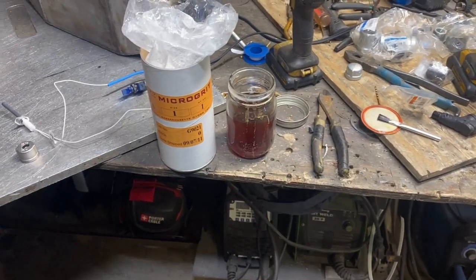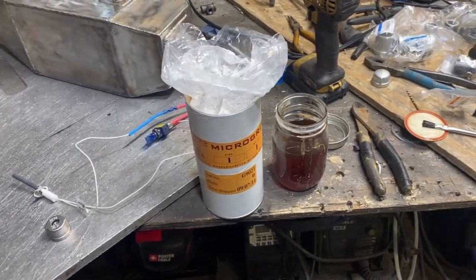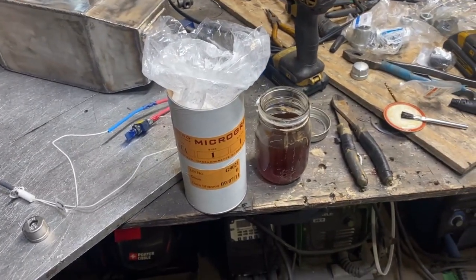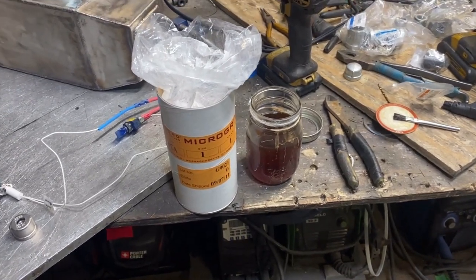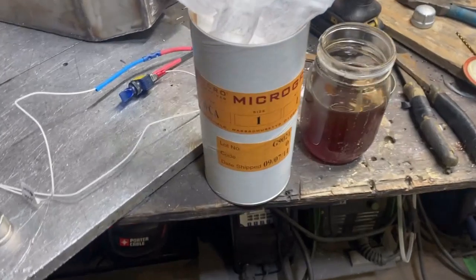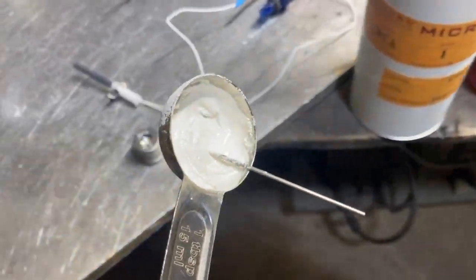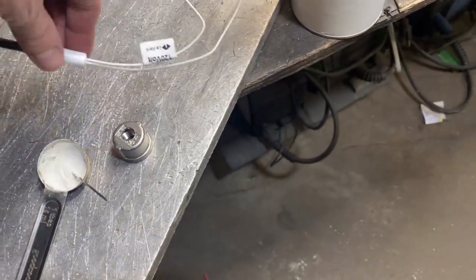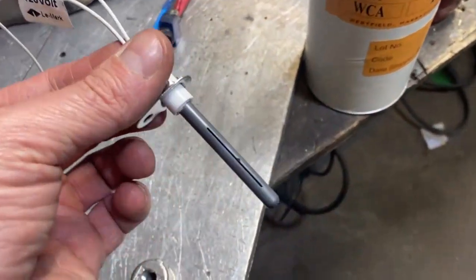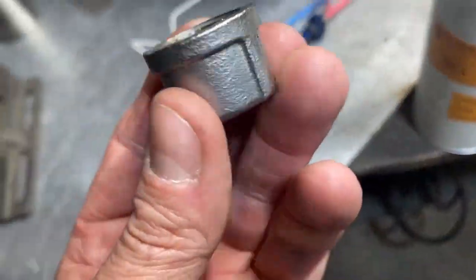This is a pyro formula for the water glass — this is what they used at the Los Alamos nuclear laboratory when they were doing some work with smelting plutonium and such. This is one-micron aluminum oxide powder, and I'm making a high-temp paste here. We're going to glue this silicon nitride igniter onto this stainless steel end cap.